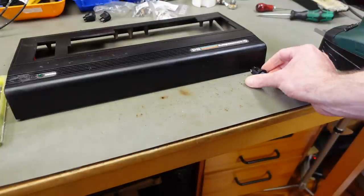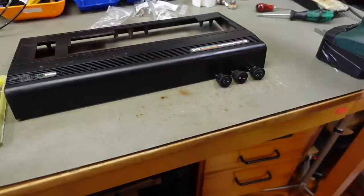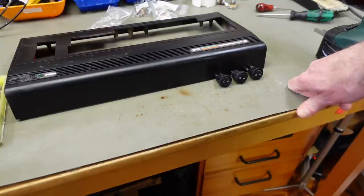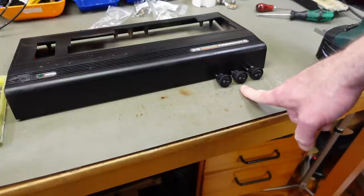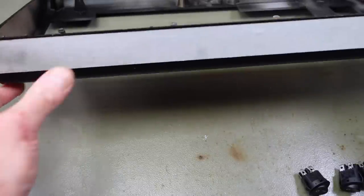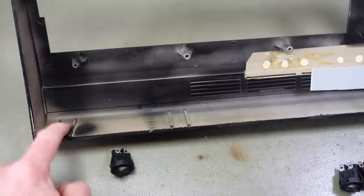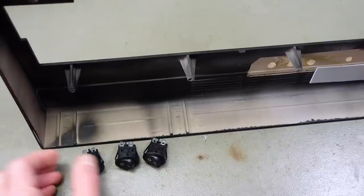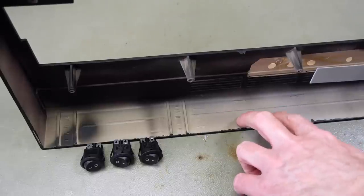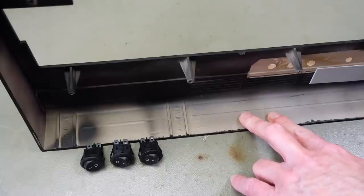And the switches shall go something close to the edge of the case here. Something like this. And we're going to pre-drill these holes and use a bit of masking tape, and then use a step drill to widen them to fit the actual switches. And the output jacks should be somewhere like here. So put a bit of masking tape on there to be able to mark stuff. And these switches should not interfere with these case hinges. So we're probably going to try to fit them inside this area here. And the audio jacks somewhere like here, close to where the audio connector on the board is. Actually, there is a pin header for that.